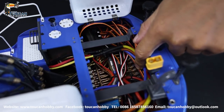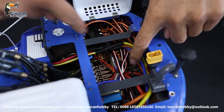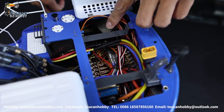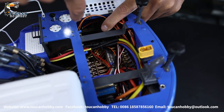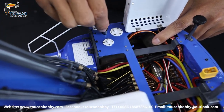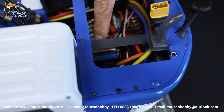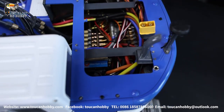Down there you can see the hydraulic directional valves. We got six channels here and two spare channels there. We added those for more functions. Under this part is the oil tank. Here is the filling for the hydraulic oil, and from this part here is the ESC for the driving motor. At the corner on this side is the ESC for the hydraulic pump.